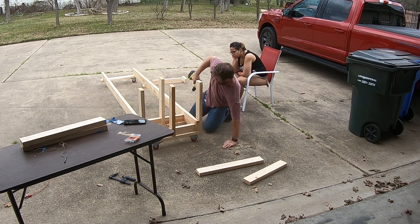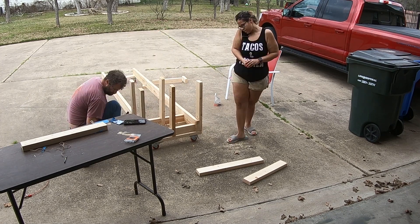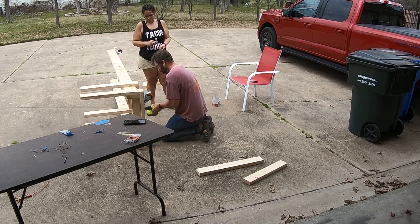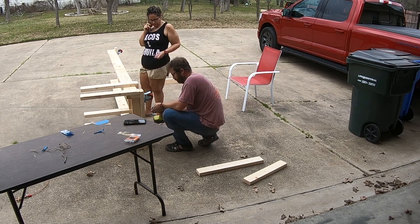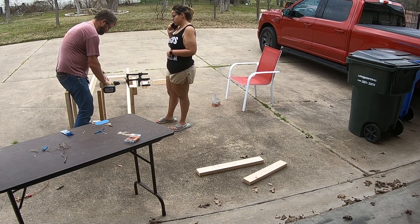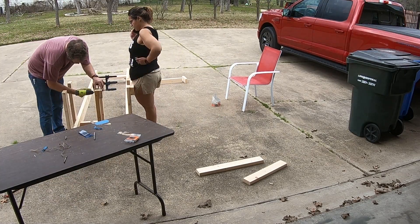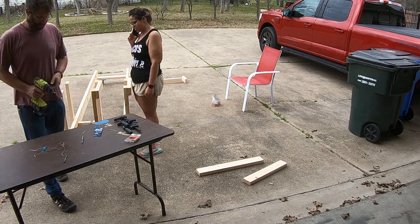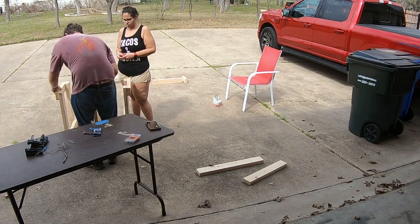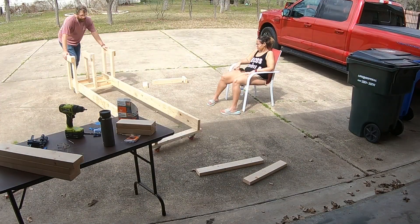To be honest, we haven't even looked through all of the plans for the quick build wings to figure out how much we'll be working on the wings while on the cradle versus taking the wing and putting it onto our workbench. We've got a lot of learning to do, but we see that everybody builds cradles like this. There are several different designs, and we still don't know if this design is the best. As we put these braces on, we're clamping them in place to get them nice and level while we drill the holes and put the screws through. We're actually countersinking the screw heads here — using a slightly bigger drill bit after drilling the initial hole — so the screw goes all the way down so it won't scratch our wings when we put the carpet over.